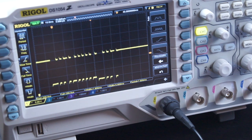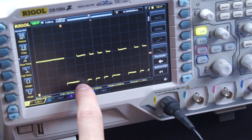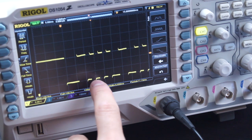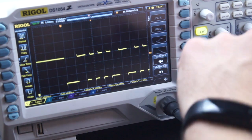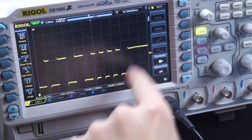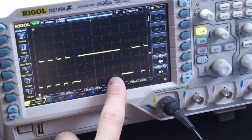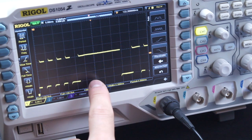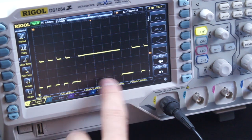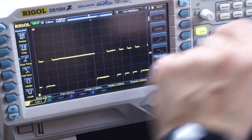If I press another button, again there is the 6 millisecond pulse as a start bit. Then we have a 1, so the message is 4 bytes long. Then we have the 4 bytes, and the last one is again the CRC. Then it waits for the answer of the telephone, but I pressed a button where no telephone is connected, so it has a timeout after 22 milliseconds, and then it will restart the message to see if it was just a false attempt.